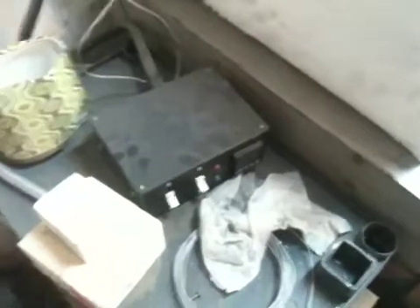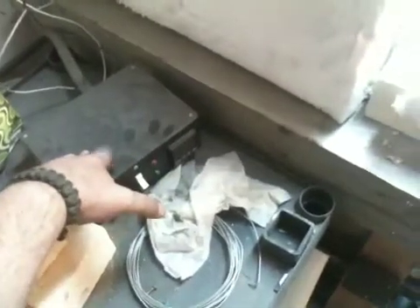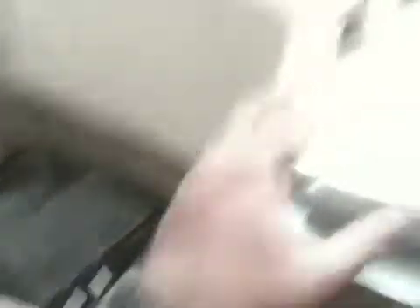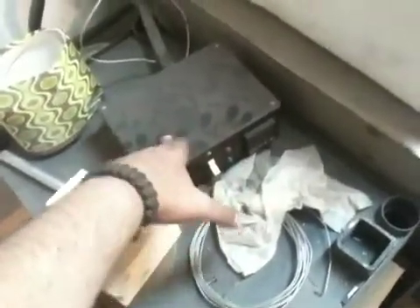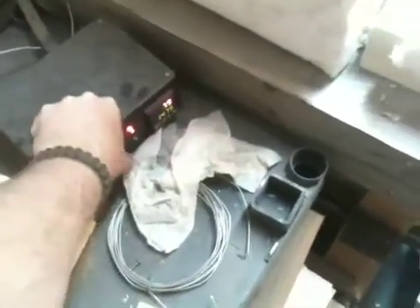The original overview I had on my Bass Thumpin' Twion channel — that's B-A-S-S-T-H-U-M-P-I-N-T-W-I-O-N — I had taken the top off and shown the insides. But as far as the insides go, it's just the controller. I have a solid state relay to control the voltage and the temperature output, plus a couple switches as well as power indicators — power on and coil on.